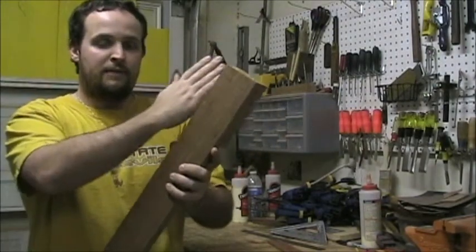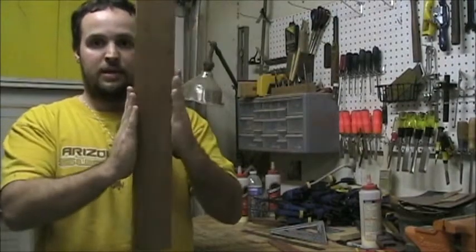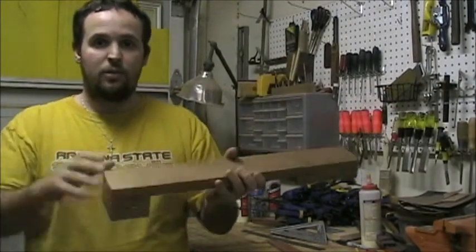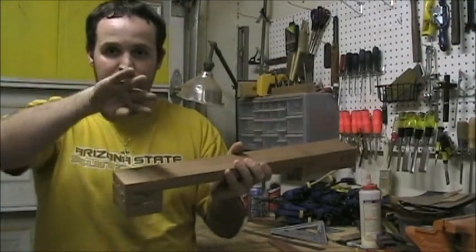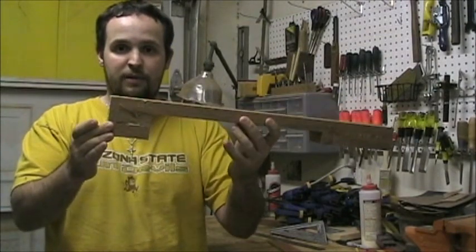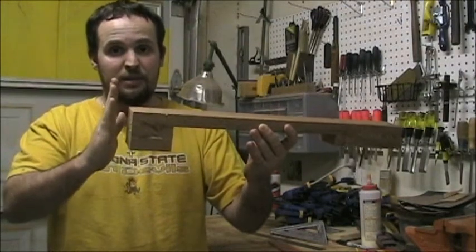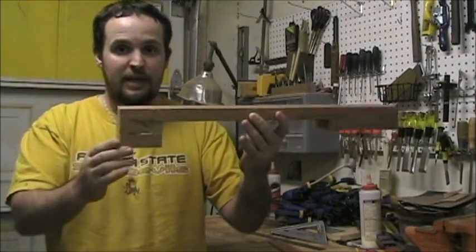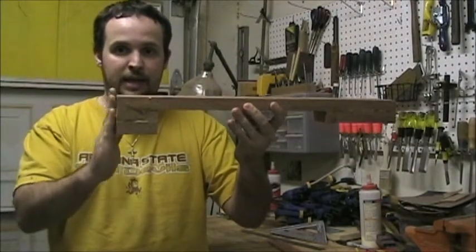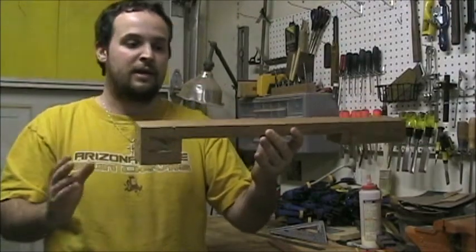After that you can start hacking off some of the excess material. The one big thing you don't want to do is change the width until the body is done. Once the body is done, we're going to check the actual angle of the top to the shoulders and check it against the angle we want here. That way, if we need to put in a little back deflection we can — or if there's already some built into the body because it didn't get a perfect 90, we'll know how to adjust the cut on the end of the piece so the right amount of back deflection ends up on the guitar.